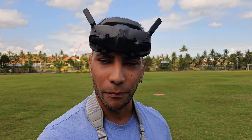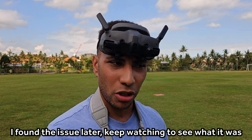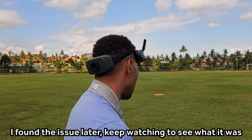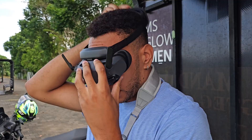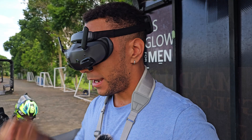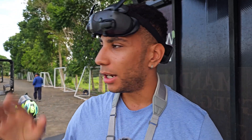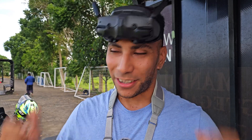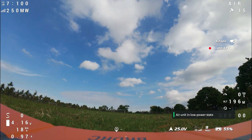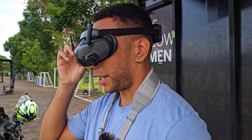Moving on to the 6 inch. I might look into the GPS loss on punch-outs — maybe it's a capacitor issue. If you've got any ideas let me know in the comments. The 6 inch is plugged in, we've already got a lock — 8, now 11 satellites — picking up roughly the same speed as the 5 inch. Leaving it to sit a bit longer for a more accurate position lock. We're now at 15 satellites, that should be plenty for an accurate position.